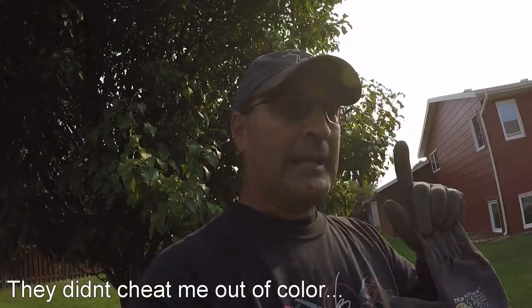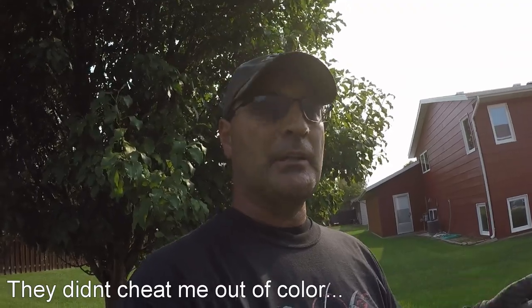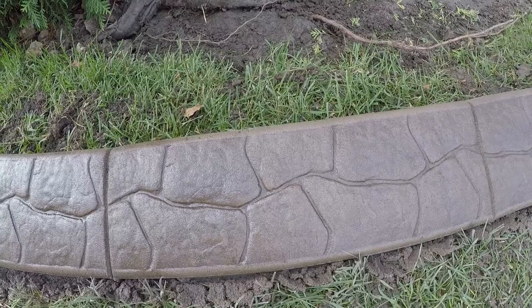I've had it happen where if you're dipping and rolling you're not getting a lot of release on top — so maybe 80–90% of your curb is the integral color. You've got to put a lot of integral color in and you're just putting accents over the top. If you do it the opposite way — make your main color the release and do this rolling method — the color will be nice and dark. The homeowner is going to say, 'They didn't cheap out on it.' A homeowner typically is not going to complain about it being too dark. They'll complain about it being too light, like you didn't put enough color in. Once you've sprayed the solvent on there it's going to liquefy and show the true release color.